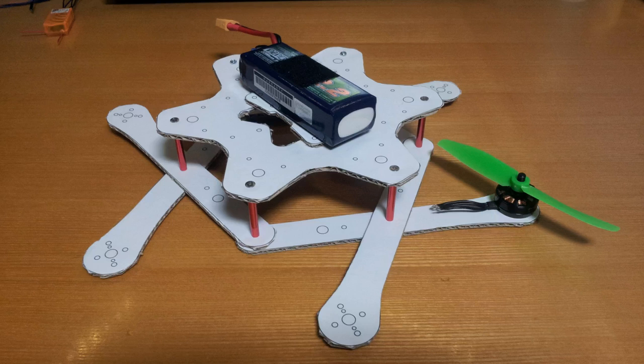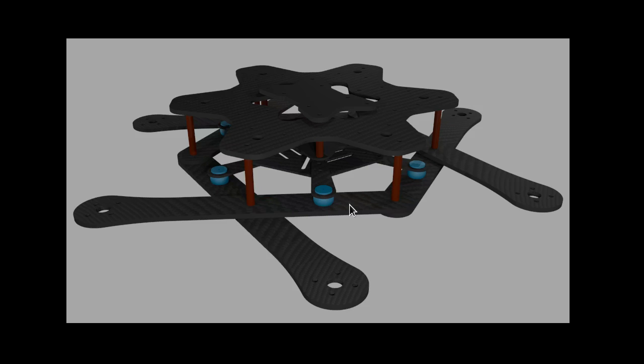These other bits at the bottom are 1.5mm thick and are just supposed to be a mounting plate for a gimbal hung underneath. I was thinking of having the clean plate sitting on top of the arms instead of being slung underneath, with the intention of keeping it very broad so there would be very little rotational movement between the clean plate and the dirty section. If the bobbins were to all come unstuck and pop off, I think this clean plate would stay inside this cage at the bottom and wouldn't go flying out separately. I'll have to put it together and see exactly what happens.